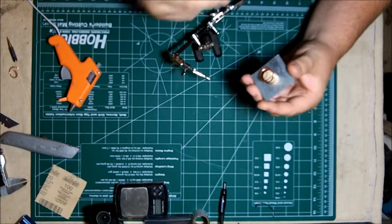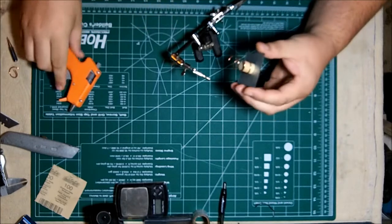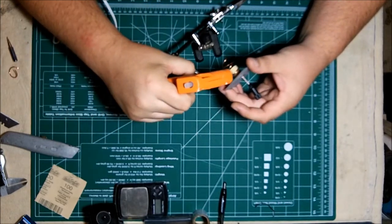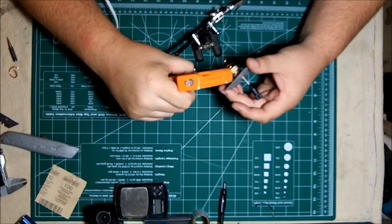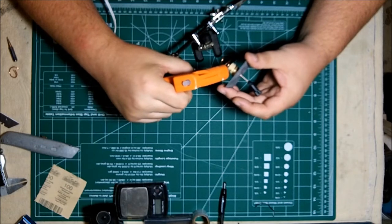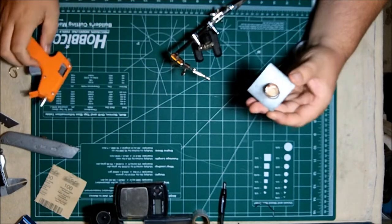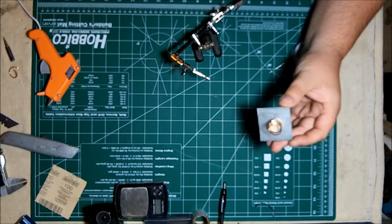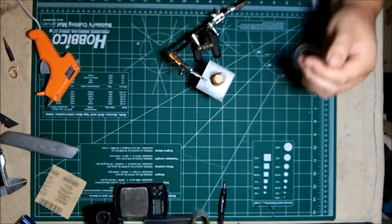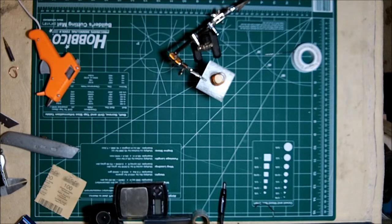Now we have a helicoil. It's usable at this stage, however it's very fragile. So I take a little bit of hot glue, and right near the reflector before it gets to the center conductor, I put a spot of glue on the coil and the dowel rod and let that set up, and that gives me a fairly good secure fit. You know, it won't withstand somebody knocking it with their hand, but for general use and abuse, it'll be fine.